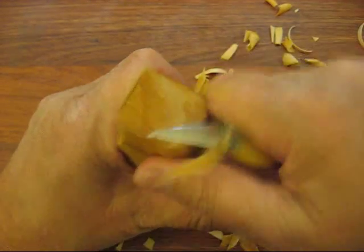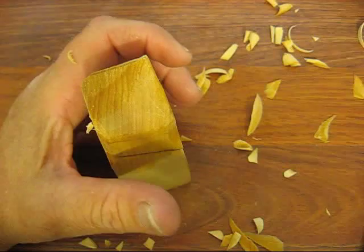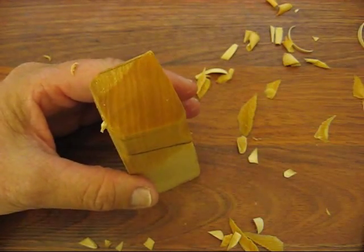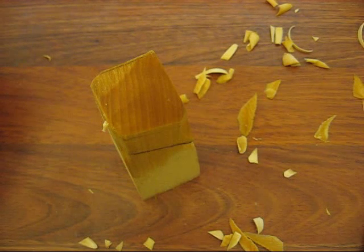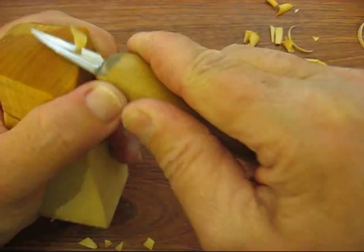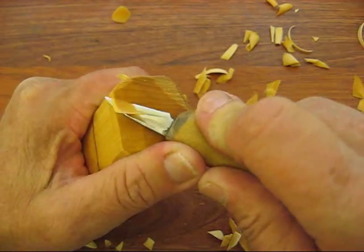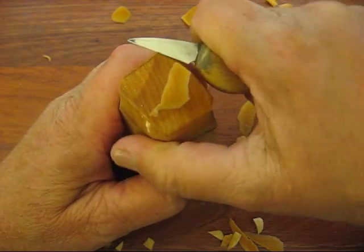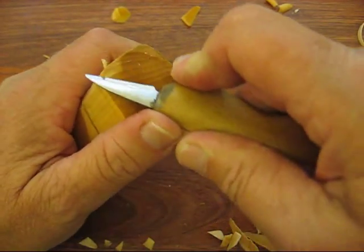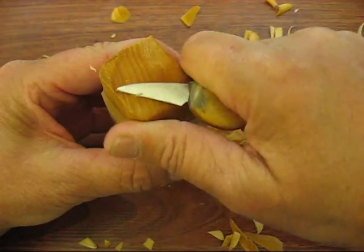See how it cuts like butter when it's wet. Now you can use water, but the reason we use rubbing alcohol is that it dries quickly. One word of caution — use it sparingly. If you soak it to death it has a real good chance of checking on you the next day. I did that mistake with my chipmunk and had like 15 different checks or hairline cracks in it when it was done. You can fix it — if you go back to that project it will tell you how to fix that with some glue and sawdust.